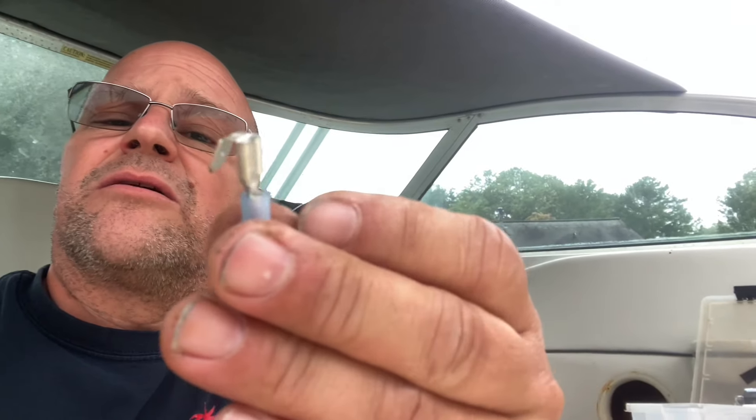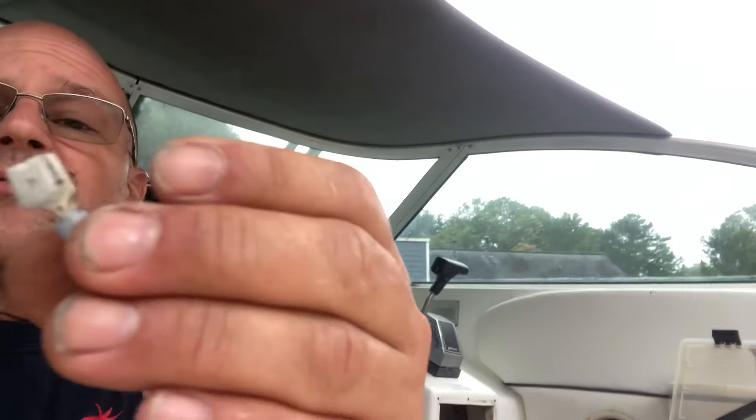The ultimate repair costs nothing. We went from a hatch drive cylinder that cost maybe $10 in screws, a little bit of grease and some RTV I already had — and then the switch. So we had the mechanical part that was failed, we rebuilt that. Then we had the electrical part here that wasn't making connection — that was just using a simple multimeter and tracking down whether we were getting power or losing power. One of the breakers was switched — makes sense that if the boat took on water it would trip a breaker. That breaker provides power straight to this bus.